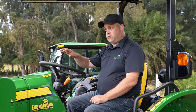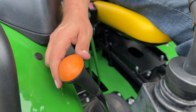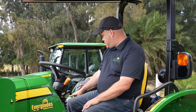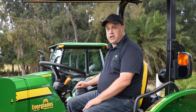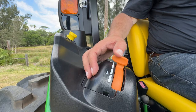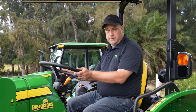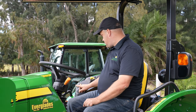Just know that if you have the loader in the up position, it's not a safety lock if you're working underneath of it — you always want to ground that. This lock will not hold it in the up position; it'll still allow the loader to settle. Your gear shift is over here on the far right, orange in color as well. Moving further up on the side fender, you've got your hand throttle — that's nice if you're doing any type of movement with the loader. Personally I like that because when you're traveling, your foot's bouncing off the throttle.